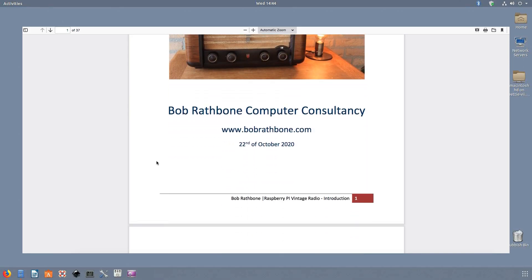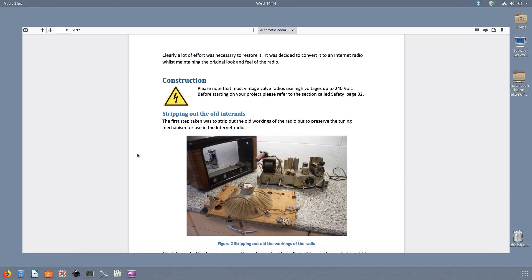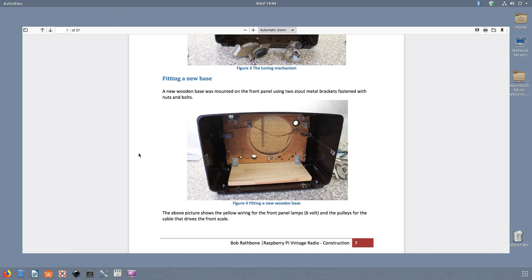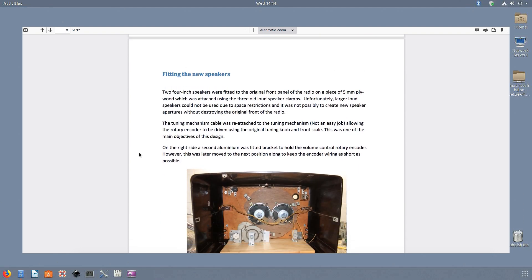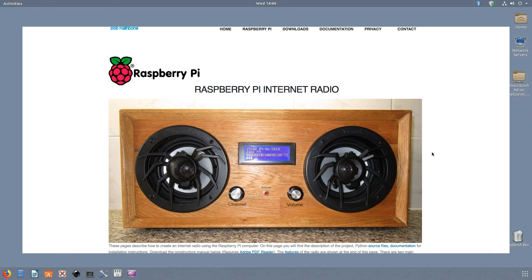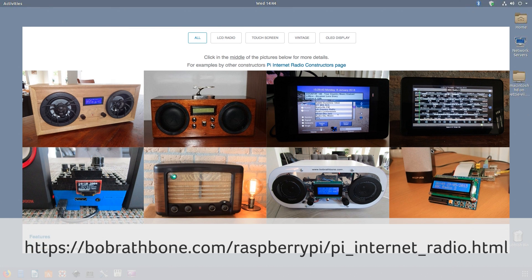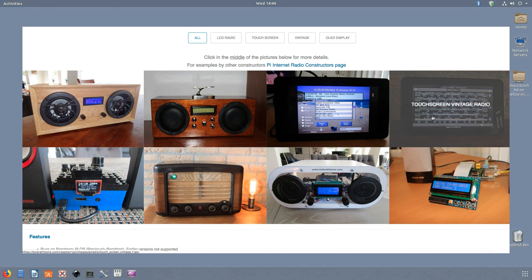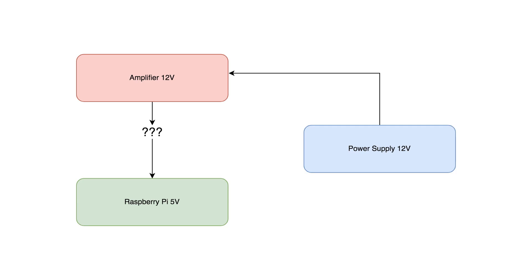Next level is boxes which accommodate a Pi and a GPIO-mounted DAC for compact hi-fi sound. After that we're into the wild west of making your own enclosures or repurposing existing ones. There is a group of people who specialize in making old-time wooden radios into modern internet radios — using the existing speakers and additional electronics and encoders to make the rotary knobs from the original radio affect the features of the Pi radio. The premier site for this is Bob Rathbone's Raspberry Pi Internet Radio page, linked in the description.